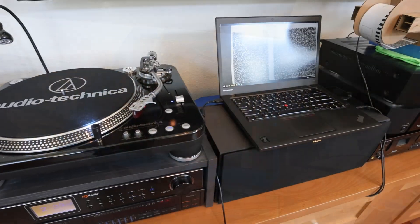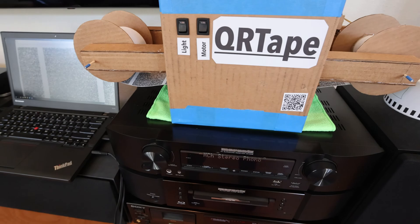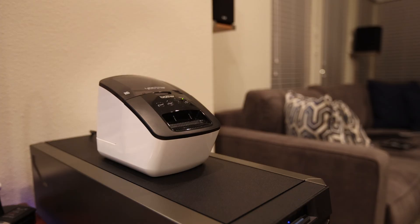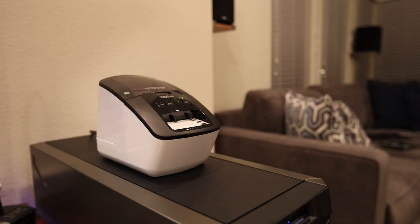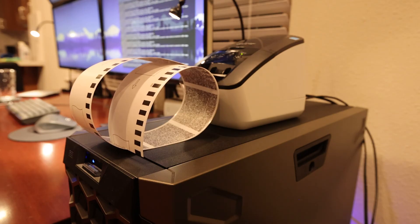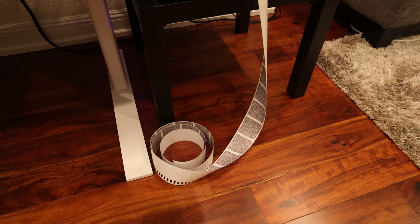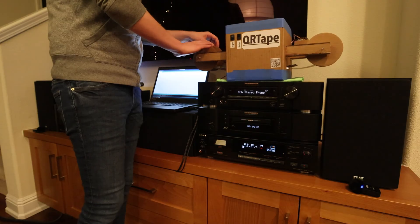When you put this hardware and software together, you get a really quirky way of listening to music. This is like vinyl records for people who want even more punishment. The final part of this setup worth mentioning is how I prepared these tapes. I used a Brother QL700 label printer with a 62mm wide strip of continuous feed paper. There is a great Python library called Brother QL that allows printing to this printer and bypassing the CUPS print stack under UNIX. Using this library allows me to disable cuts, enable high resolution printing, and script the printing of an entire song with a simple bash one-liner. The print process is very slow as the thermal printer throttles very quickly. The song showcased at the beginning of this video is just a little more than 4 minutes long and requires 157 barcodes to store it. Each barcode takes nearly 20 seconds to print due to the cooldown times necessary between prints, so it definitely takes a while.